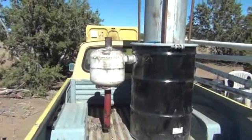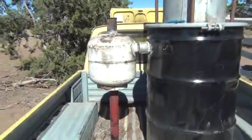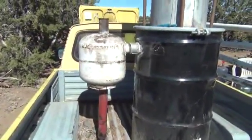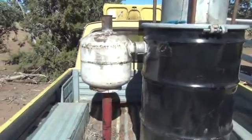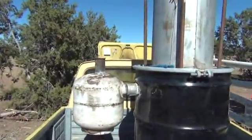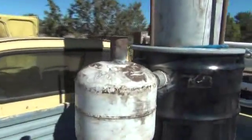We've got the completion of our cyclone done now. I just wanted to show you the dry set sitting off the reactor side. You'll notice the downspout is now welded into place — that's the red pipe out of the bottom of the cyclone, where the ash and heavy crude is going to settle down into our collection tank below. Out of the top, you'll notice the outspout for the gas out is welded together. We're going to go ahead now and put a box off the top of this and go into another collection tank and a couple of radiators, and I'll show you those as I get them done.